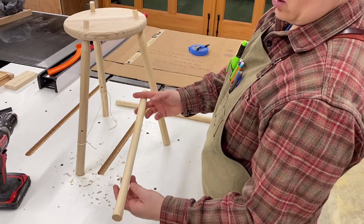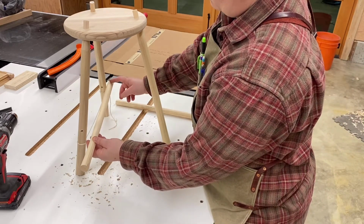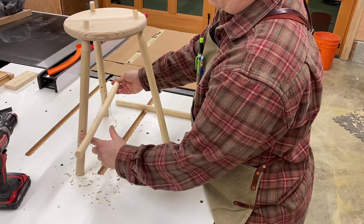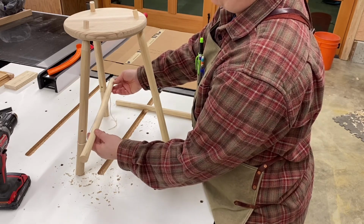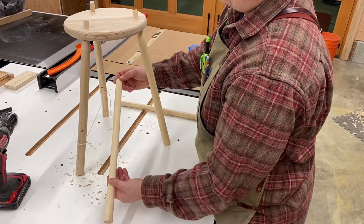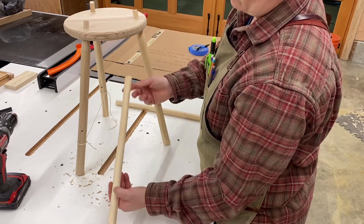I think that, yeah, I'll go ahead and taper this end, and then I'll know that I get to cut this end back where this starts to thicken back up in diameter. So that's what I'm going to aim for. I'm going to go over, use the tenon cutter, exactly what you already know happens with this guy, so no different.